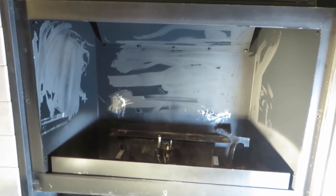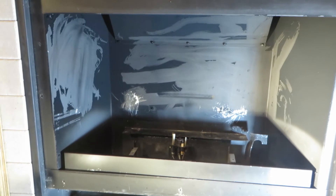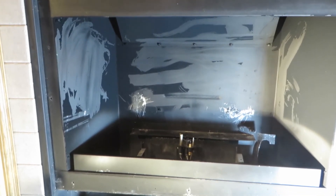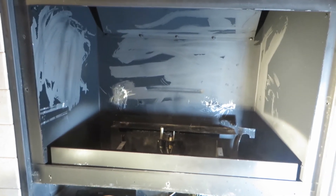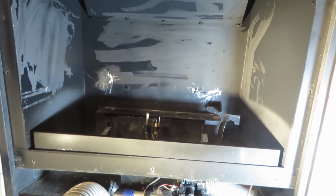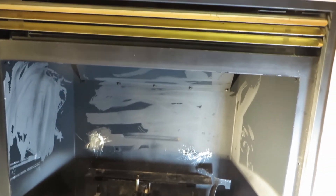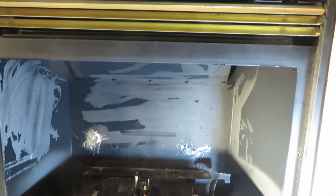This is one of the reasons you do not want to convert a wood-burning fireplace — make it airtight and put gas logs in it — because it doesn't have that safety feature. This is a direct-vent fireplace that vents from literally the back, with an exhaust system that goes out through the back of the stove and through the wall. There's no chimney going up — it's a very simple installation.